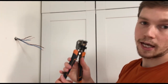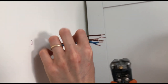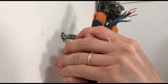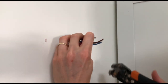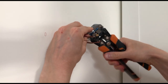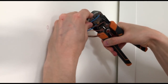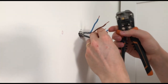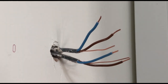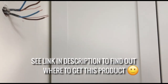Get your cable strippers - the cables are off so it's safe to touch them. Push the cables back into the wall and you want about two inches of cable sticking out. Cut all of them at the same time, then strip the brown wire to about a centimetre. The great thing about an automatic cable stripper is that you know you haven't damaged the cross-sectional area of the copper - damaged copper with thin sections can cause heated wire and potentially a fire. Always use an automatic cable stripper.